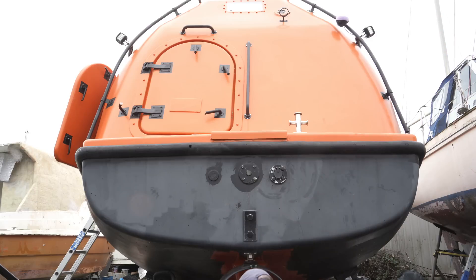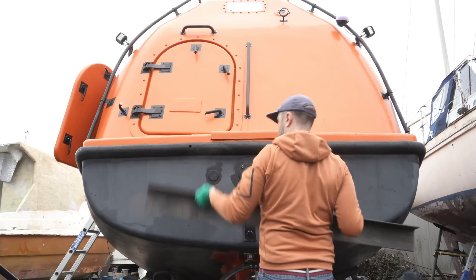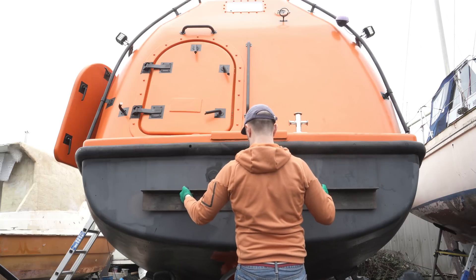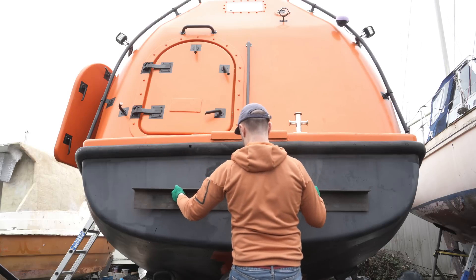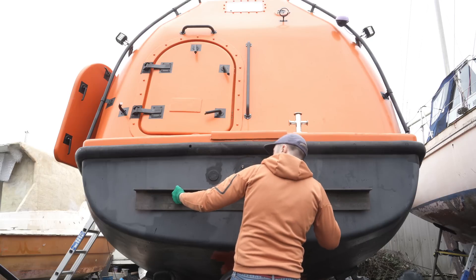Positioning will be quite important. It's heavy, so not too high up. It also needs to miss the existing features. Above is the exhaust outlet, plus the old spigot plate and where the fuel tank breather used to exit. Below is a huge stainless plate from the old lifeboat davit days - I can't weld the steel to this, as they would have a disagreement of galvanic proportions.